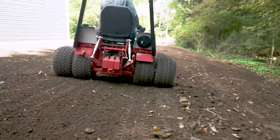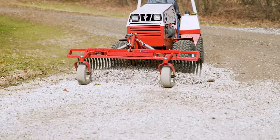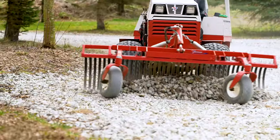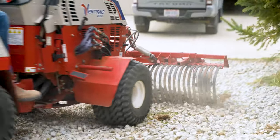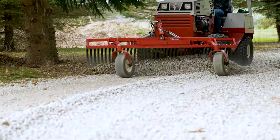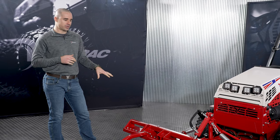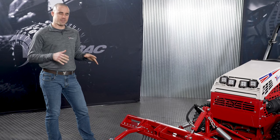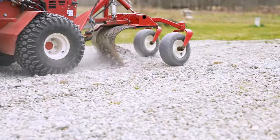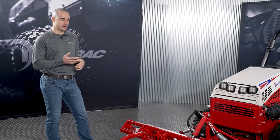On that site we were maybe two acres or something like that — a really big portion. So if you have to do that by hand, it's just not going to work for you. I've also successfully used this on my own driveway to spread gravel around and just re-level. It's a little less invasive than a power rake. If you're in maintenance mode and there's still gravel that gets pushed out to the turns as you drive around, this does an incredible job of re-leveling and moving that loose material on top in a matter of minutes. It takes what could be a multi-hour or whole day job with hand tools into just a couple minutes of maintenance.